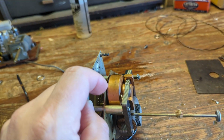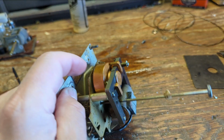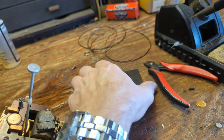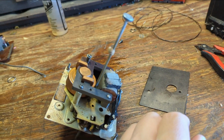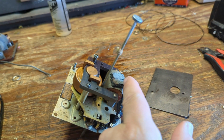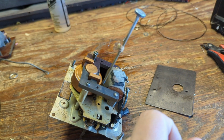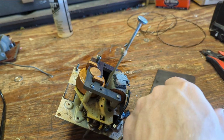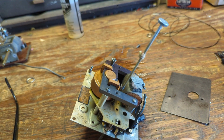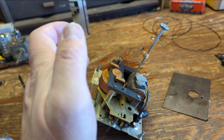So we're going to take this rotor out and we're going to free it up. Even though it is turning, it is causing a lot of noise. I also don't understand why this plate was attached back here. In fact, I think I know why it's vibrating. That used to be foam. Now it's solidified nonsense. And that probably provided a cushion between this plate and this, so that's just amplifying the vibration that the rotor's putting out.